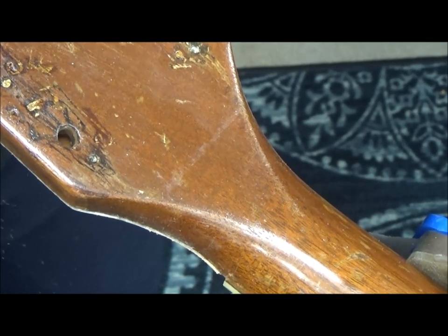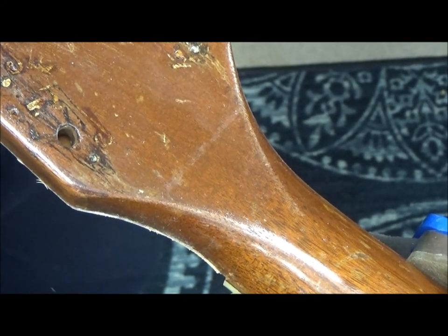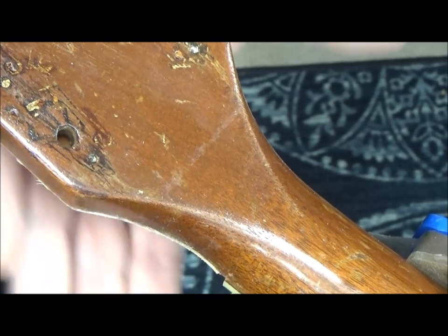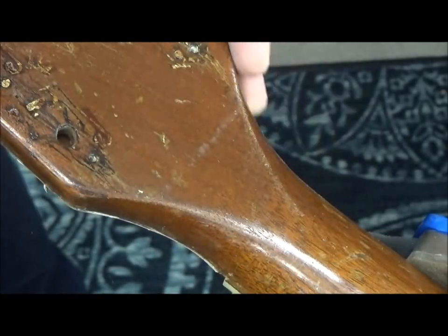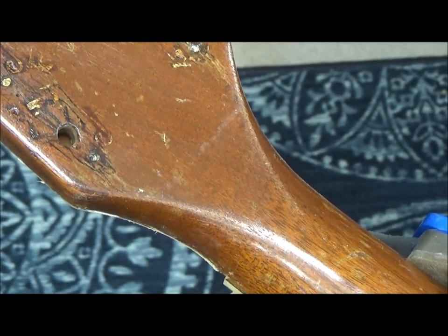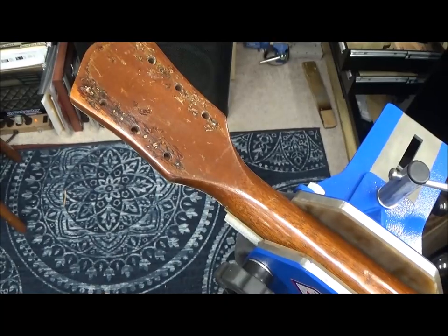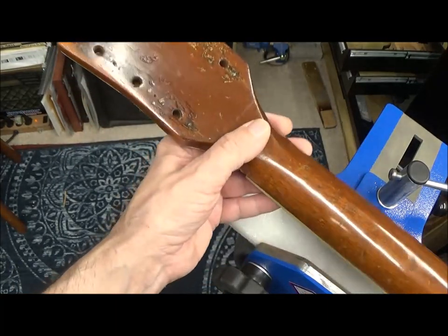Main thing is it's not toxic. I can only do lacquer in the spring and fall — that's the only time I offer lacquer finishes for my clients. Shellac finishes I can do year-round indoors in a nice humidity-controlled space. When I'm spraying lacquer it's out in the big garage and it's harder to control humidity and temperature. In Nashville, Tennessee — and really all across the lower midwest, Kentucky, Ohio, southern Indiana, Illinois — spring and fall is the time to be spraying.